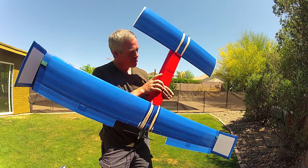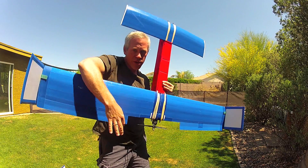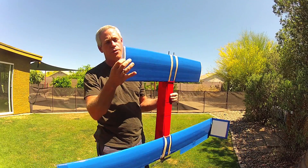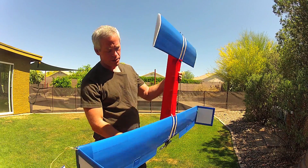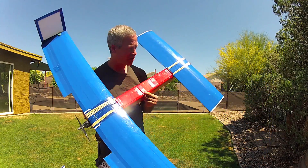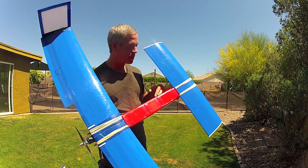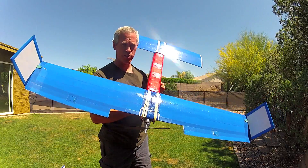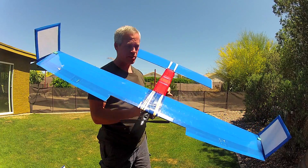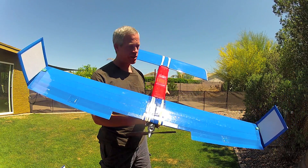Here's the larger version, which is a two-and-a-half-inch nominal fuselage — two and a half inches inside, three inches on the outside — with a seven-inch chord and a one-and-a-half-inch elevon, and a seven-inch chord canard with three formers in each to provide the airfoil shape. This is more the heavy lifter with a larger power plant, larger internal capacity — could quite easily fit four, probably six of those packs. This one glides a bit better due to the increased wing surface area. The performance was, if anything, a bit smoother, like driving a Cadillac, while the smaller one was sportier and more nimble.